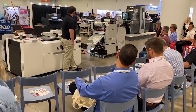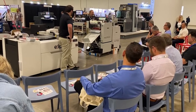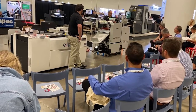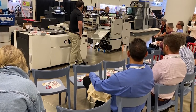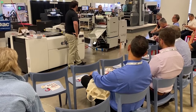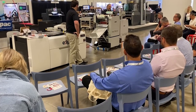You're going to be running at a rate of about 400 12-by-18 sheets an hour, give or take, whether you're laminating or foiling. The variables that come into play include your print engine — some engines like Konica Minolta and Xerox can be a little more difficult to laminate, so you may have to run a little bit slower and hotter. Also, how much coverage you have matters: if you're running a solid black book cover, you'll probably have to run a little bit slower. If you're running soft touch laminate versus gloss laminate, soft touch takes a little more heat and time to cure into the paper.